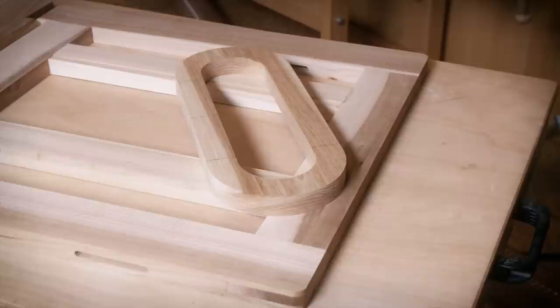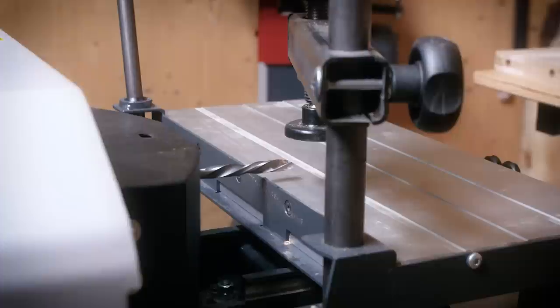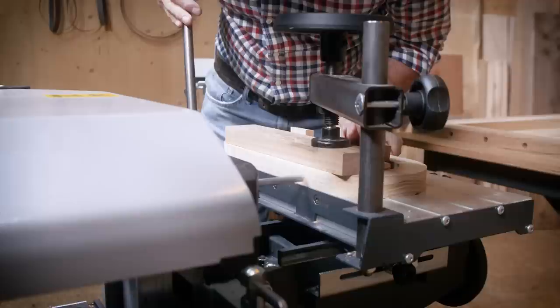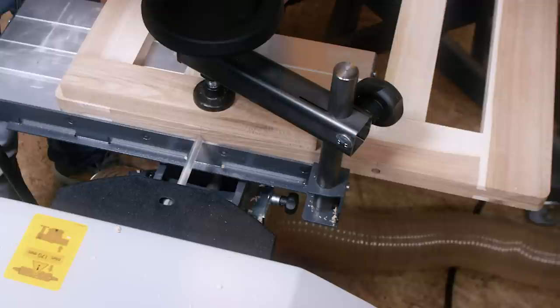The holes for the headrest are also drilled at this point. These are bored with a 10mm drill bit. Pay attention to protect against tearing on the inside. Bore the holes on the backrest side of the headrest as deep as possible.